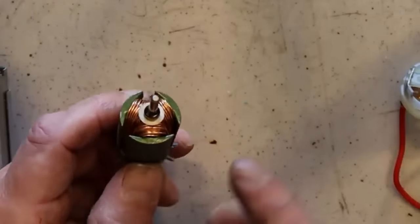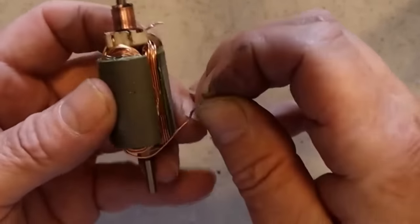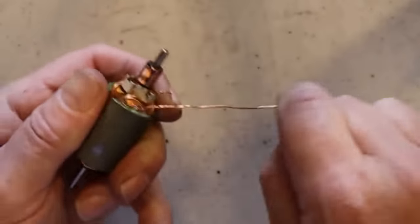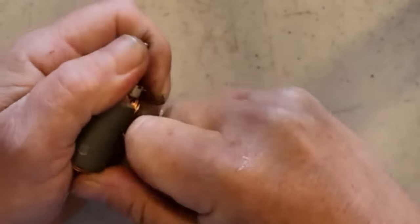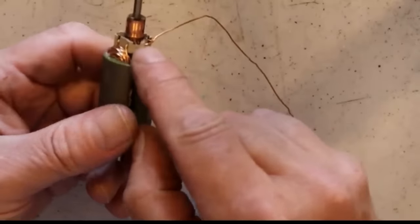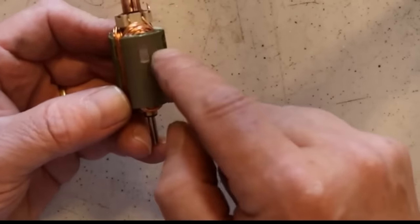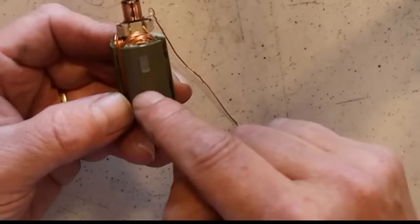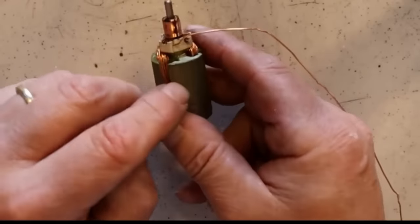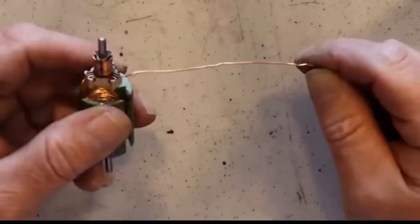So what we're going to do is rewind this rotor. As we follow that wire we can see it begins there, and we unwind it — it unwinds in an anti-clockwise rotation, which means it was wound clockwise. So let's unwind all of those. When you've unwound it, it goes into that section of the commutator — there's a clip on this — and then it comes out. Each one is anti-clockwise unwinding, so each was wound clockwise: start point, turn it clockwise, into the clip, out. There are 24 turns of 0.6mm gauge wire.